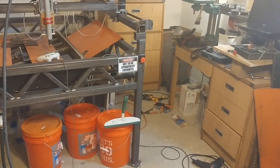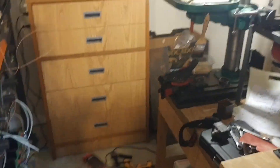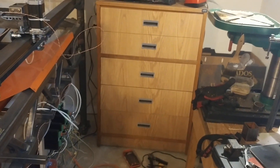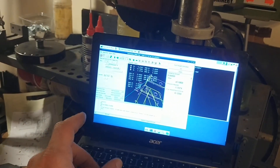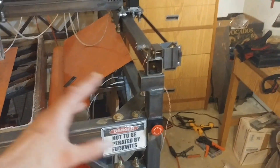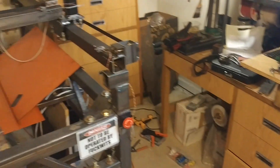I have not had any problems with the Wi-Fi connection when running the plasma. I'm running LinuxCNC on the computer down there but accessing it on my laptop up here. The VNC server running down there — Virtual Network Connection — lets me use a client program on this computer to connect to the GUI and access all the controls. The reason for that is I didn't want another monitor and keyboard hooked up to that computer. There's enough crap in the shop as it is.